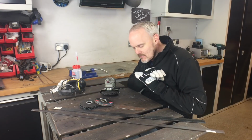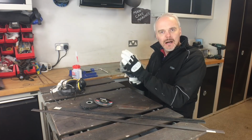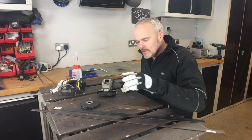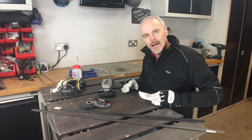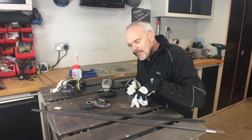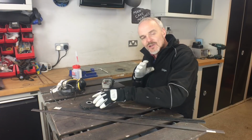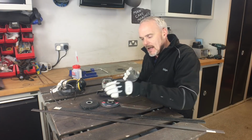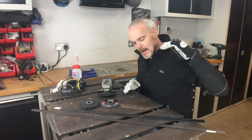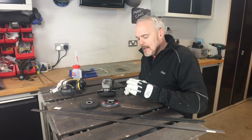It's just a no-go. I use a little grinder with a flapper wheel to shape and mold material, putting edges on things, that kind of thing. But these things are not great for surface prep, because you're removing the base material from that, and it leaves pretty big scoring marks on there.